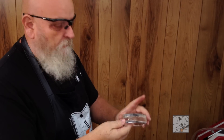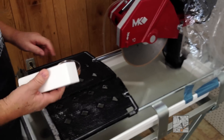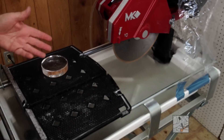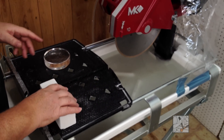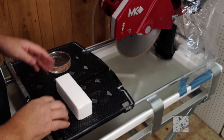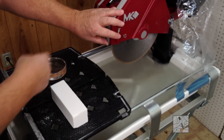I have a little billet of BK7 glass, but as far as saw blades are concerned, glass is glass. Many of you may argue with me, but whatever is right for each of us. Now, starting with a brand new result blade — and this may be true of other blades as well — because it does not come dressed for a particular direction, I'm going to dress it. You can take two small slices off of it, and then I will always remember to keep it in this direction.